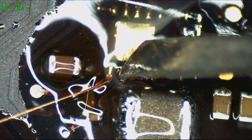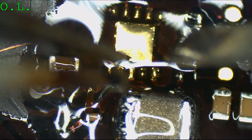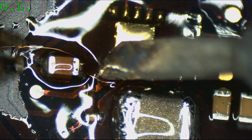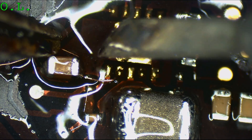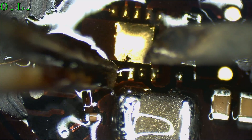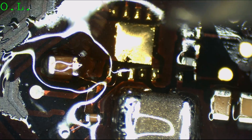I have to run a jumper to the input, but input is right next to output on the right and feedback on the left. So I have to run this there without it touching the adjacent pins. We have about two microns of clearance — that's more clearance than Apple gives the data line from the 40-volt backlight on the LCD connector anyway. I'm sure it'll be just fine.